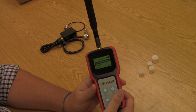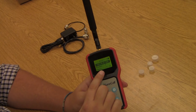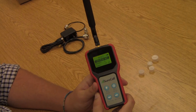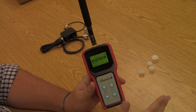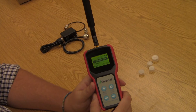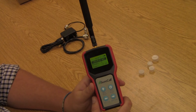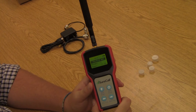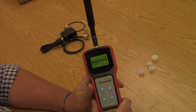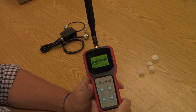Let's talk about that power level. The power is what we're going to be looking at when we're getting our signal readings. On the meter, if you are reading max gain, that means the power level is better than negative 40 dBm. On the low side, if the signal meter is reading negative 110, that's the lowest it will be able to read — so if you're seeing negative 110, it could actually be negative 114 or negative 120. We want to be aware that negative 110 is the floor of what the signal meter can display.